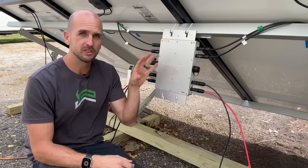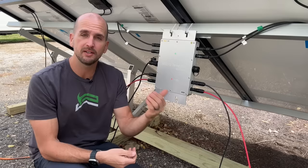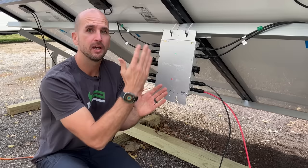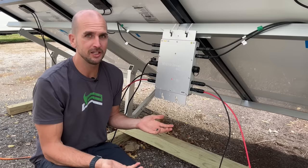Before we open this up, let's talk about local codes. I checked with my local building inspector and he indicated that as long as it's certified UL 1741, it would be acceptable. UL 1741 is a safety standard requiring that anything plugged into the grid that produces power must monitor the grid — whenever the grid goes down, the inverter shuts down and doesn't back-feed onto the grid. I tested that by hitting the main breaker and using a multimeter to confirm no output, and it does have that functionality. However, I can't find any actual UL certification for this unit, so it probably would not meet the standards of my local inspector.